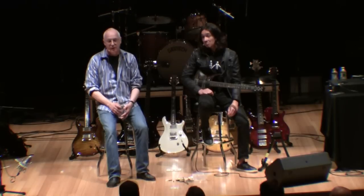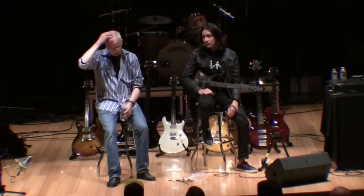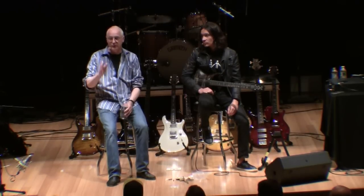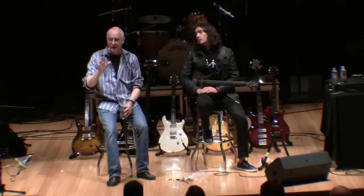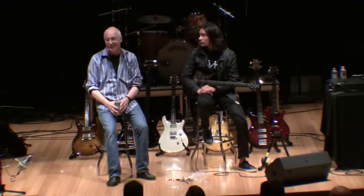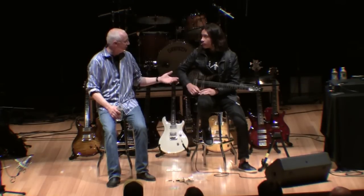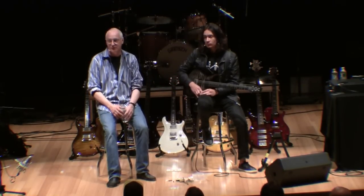You can try them. We have an extraordinary way of carving the necks. We don't carve them rough and then sand them into place. We spend a lot of time with the CNC going back and forth until that neck is exactly the right shape, so when the guy sands it, he doesn't have to take very much off. The Holcomb models that you played, all the necks have been the same shape, right? Yeah, same exact shape. Right. Does that answer your question?